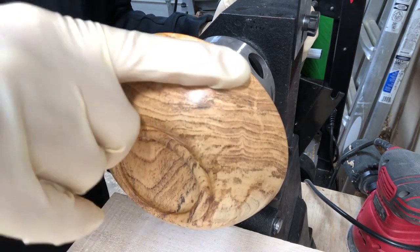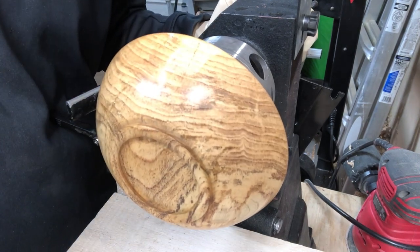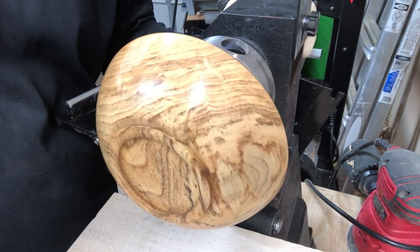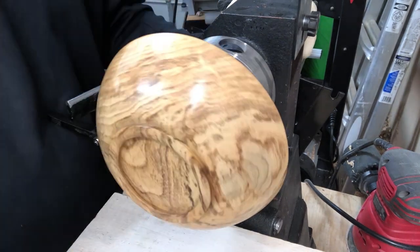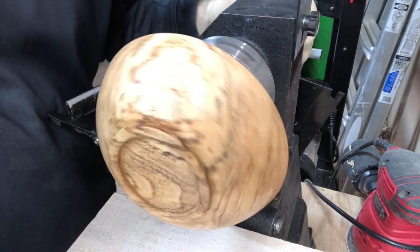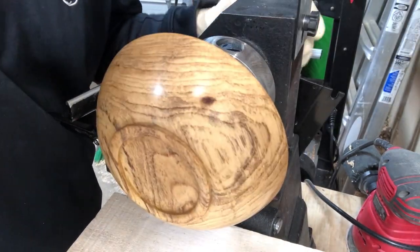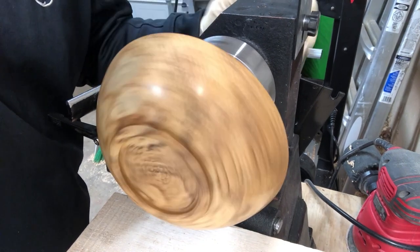It's got to be because of the glue. So maybe, because I went with a high grit sandpaper, because that's kind of what they did, maybe I need to go with a lower grit to sand off some of the excess. I don't know. So we'll try that next time we have a crack and we have to fill it. Either way, though, that shine, I think, looks really nice on it. I'm trying to block some of the light so y'all can see the actual shine, but not all the light.